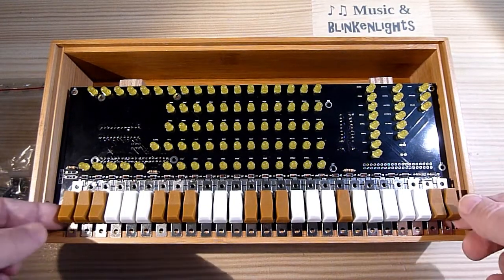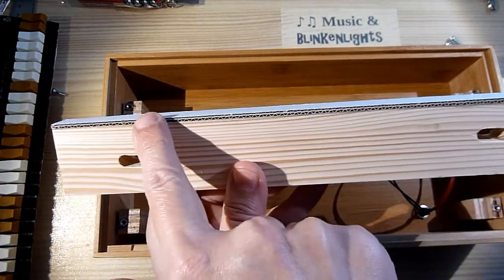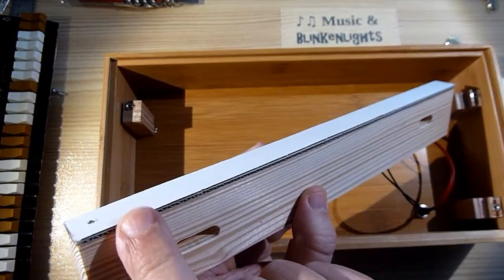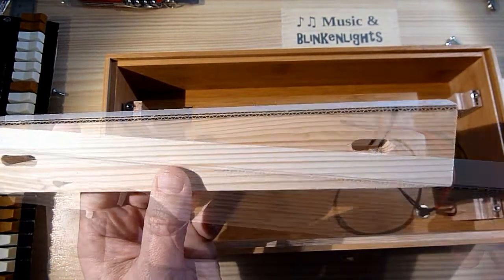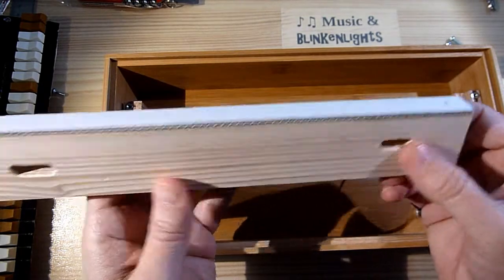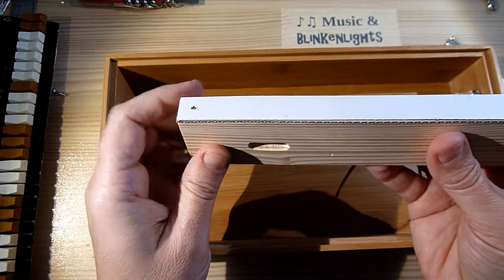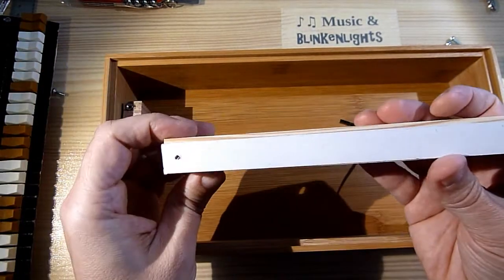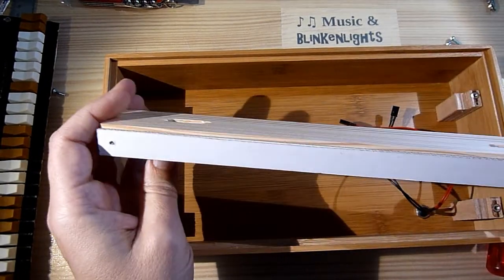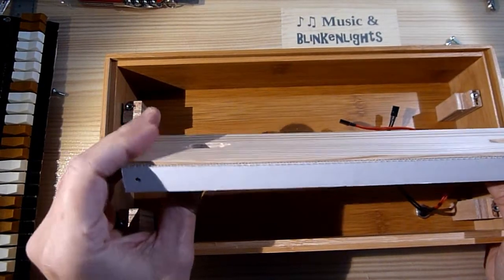However, there were several problems with this method. First, the long block was not high enough for the PCB to lie level in the case, so I had to add two layers of cardboard on top of the block. Incidentally, I also added two slits because I hadn't quite decided yet on how to wire everything up. Anyway, I found it difficult and awkward to drive the screws through the mounting holes on the tabs of the switches. So after some trying, I eventually decided to deviate from the instructions.